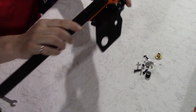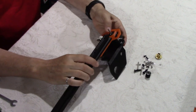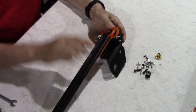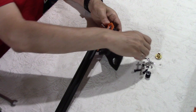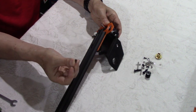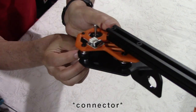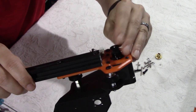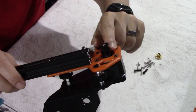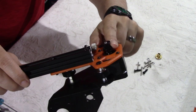Now we can install the motor in the bracket. The holes are wide, which will help us put tension on the belt. For now, tighten the motor all the way to the right so we can move it left to add tension later — using the four small black screws. Make sure you install the motor with the bracket facing down. Now we can install the gear on the shaft — we won't measure the height because it's easier to align it with the belt later.